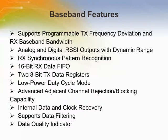The MRF49XA is a fully integrated sub-gigahertz RF transceiver. This low-power single-chip FSK baseband transceiver supports zero IF architecture, multi-channel and multiband synthesizer with phase locked loop, power amplifier, low noise amplifier, IQ down converter mixers, IQ demodulator, and baseband filters and amplifiers.